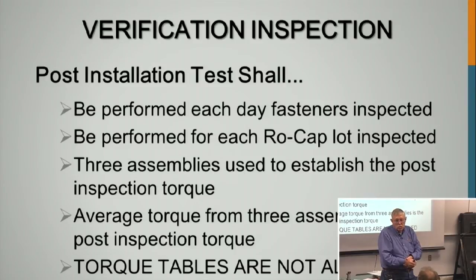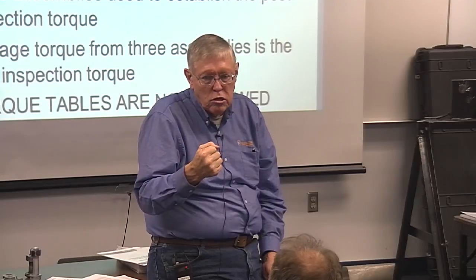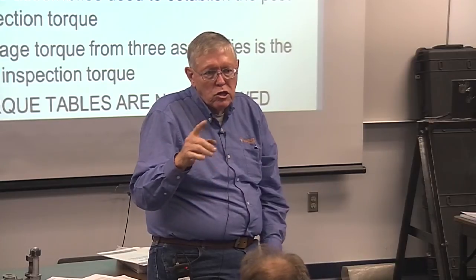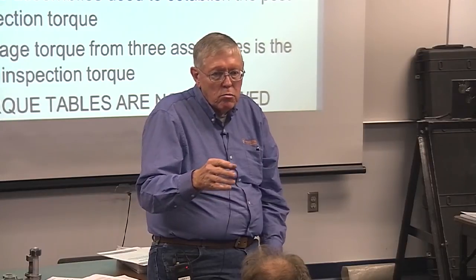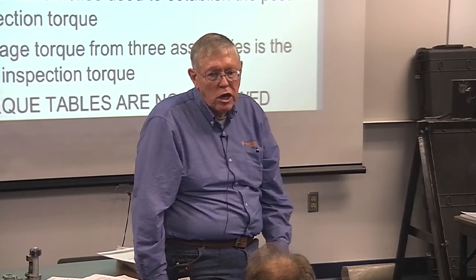How do you know they're going to get tension? Well, if you're using DTIs, that's one thing. Well, what are you doing to the bolts when you try to squeeze the DTIs down? That's one case where the DTIs probably benefit you, as long as they're under the unturned element. Because they should be under the unturned element so that you know you're tensioning the bolt through the structural steel. If it's under the nut, under the turned element, all you know is that you've compressed the nut against the DTI, and the DTI might crush, but have you put tension on the back end of the bolt through the steel? You don't know unless you've got the DTI on the back side.